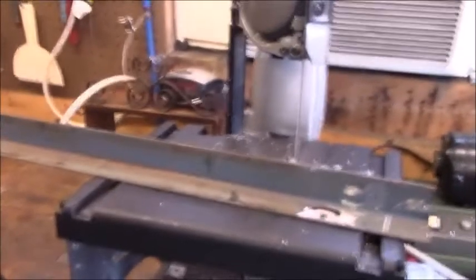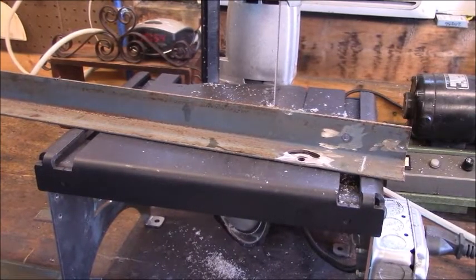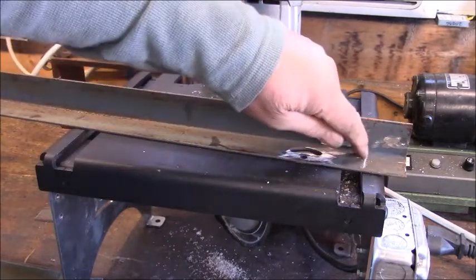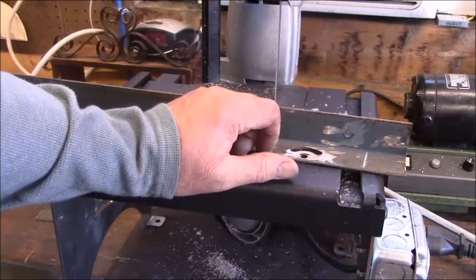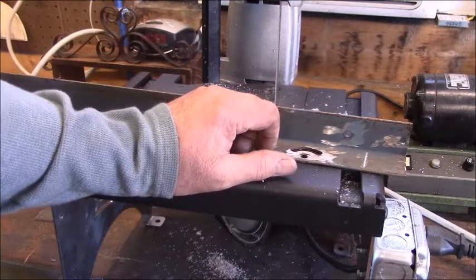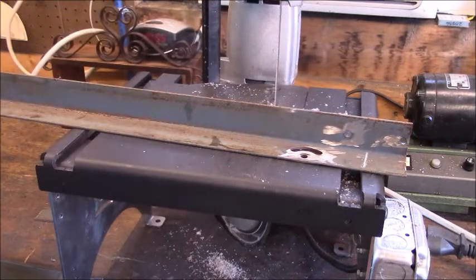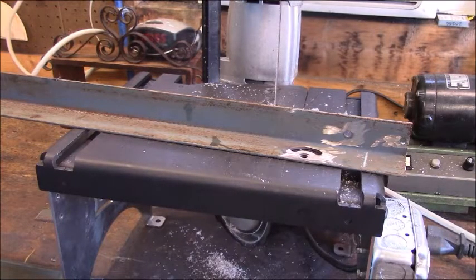All right. I like to build a box and I'm not a professional fabricator or welder, but I don't like doing cutting stuff on the 45. What I prefer to do is cut this lip out of this angle here. Then I will build my box by basically having this whole corner area to be welded in, so you've got a lot more area to weld and it's easier to get to when you're welding it. So for me it works better. And most every box I build, I build them this way.